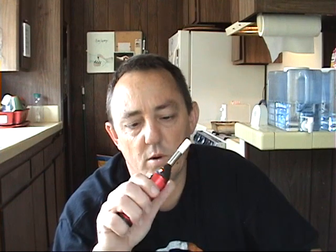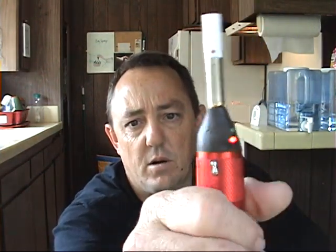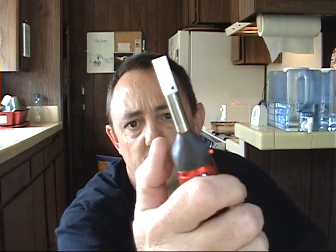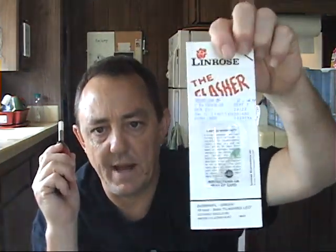Right before the batteries are dead, it'll just stop hitting. I have two LEDs on this one: a red one that lets you know it's on, and there's a power lockout switch on the bottom. The green LED shows you when you're pushing the button. The detonator I'm making in this video is going to have a flashing green LED that comes on when I push the button, and a red LED that's on when the power's on.